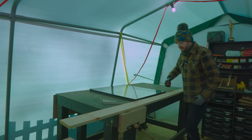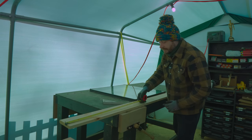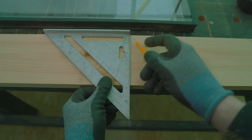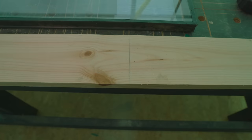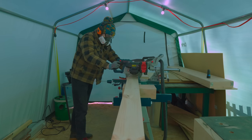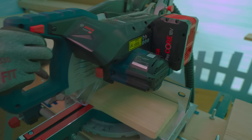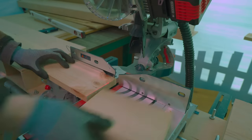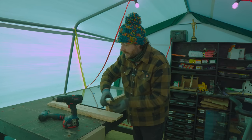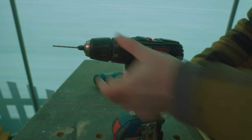What I want to do is make a box around the windows, so I just need to measure them, mark out and cut four pieces on the mitre saw, and get them screwed together. I've now got the bits cut for the four sides, so I'm going to get a countersinking bit in the drill and get these glued and screwed together.